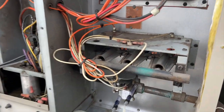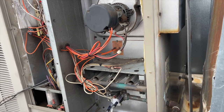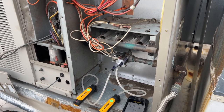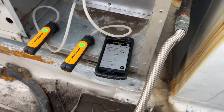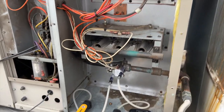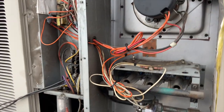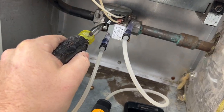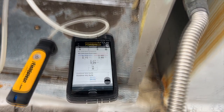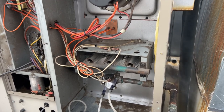We got ignition. The flames are yellow just because of all the dust. One thing when you're changing out a heat exchanger - when you fire it up for the first time, let whoever's in the space know it's going to stink because it'll be burning off oils and stuff from construction. Our gas pressure's pretty high so we're going to turn that down - we don't want the new one to crap out. The fan has already been changed from last time I was here. Sometimes the burn-off can actually set off smoke detectors, so let them know and probably open up the windows. Hopefully this helps - thanks for watching, make sure you like and subscribe!